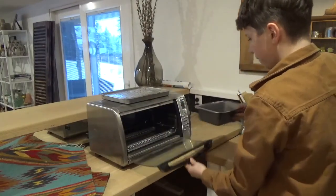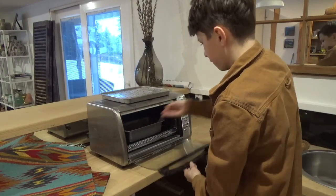For tempering, you put it in your home oven, or I'm going to use a toaster oven, at 400 degrees Fahrenheit for two 2-hour cycles. In between the two cycles, you take it out and let it cool to the touch. That brings the hardness level down a tiny bit so that it still holds a really good edge, but it's also very durable. So if you were to drop it or hit it against a piece of wood, batoning or something, it's not just going to break. So that is the heat treatment process, actually making a knife, and that's what we're going to be doing right now.